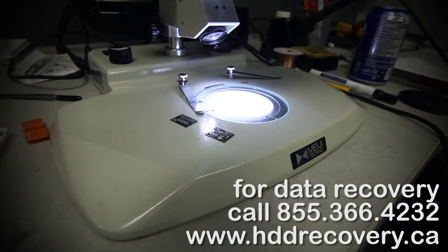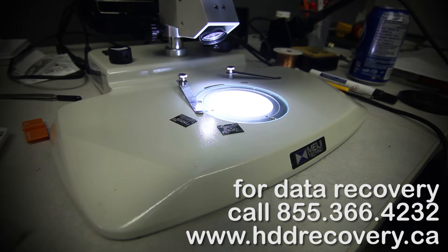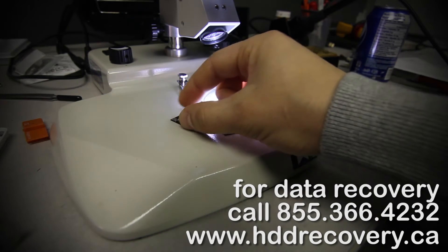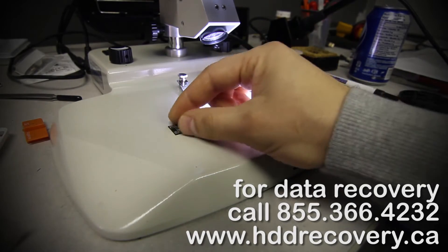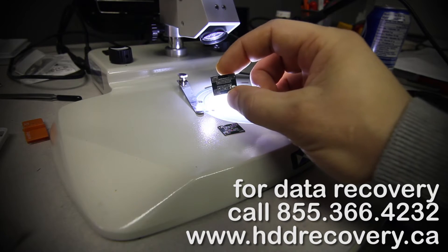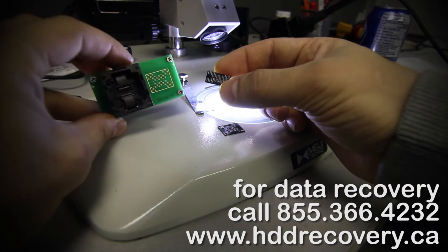The next step is to perform a cleaning process on those chips — basically wick them up so the surface is flat and we get rid of all the excess solder. I'm going to put them in the bath. This is a BGA 152 memory component packaging, so we need some way of accessing and connecting to the pins on the back.